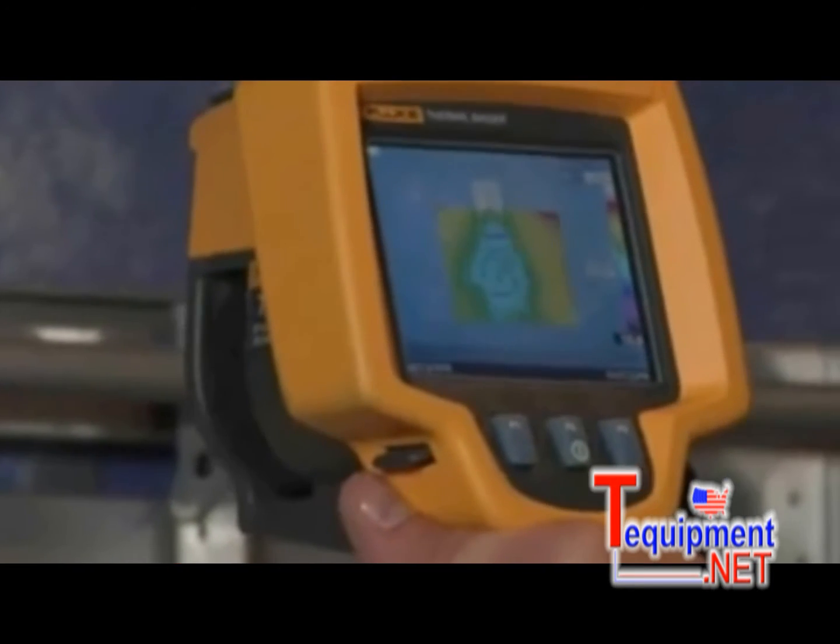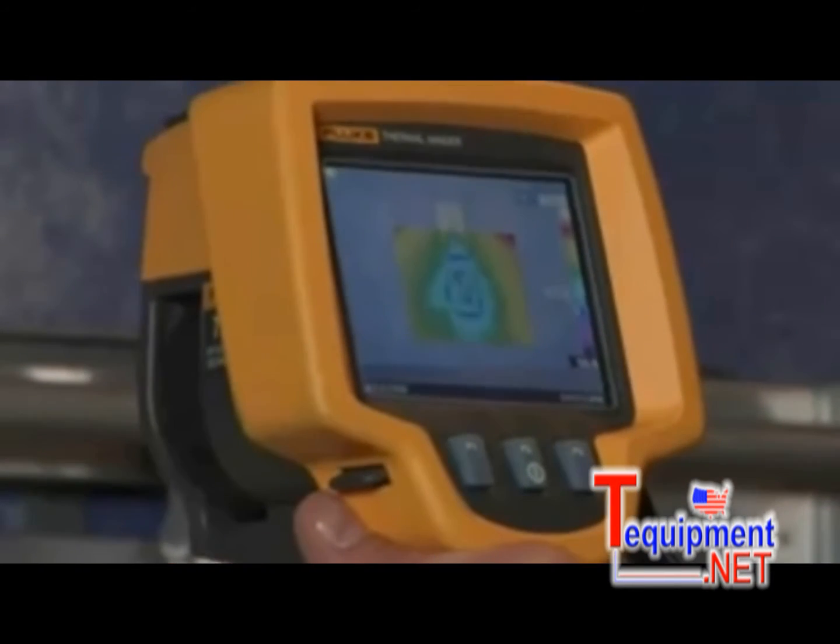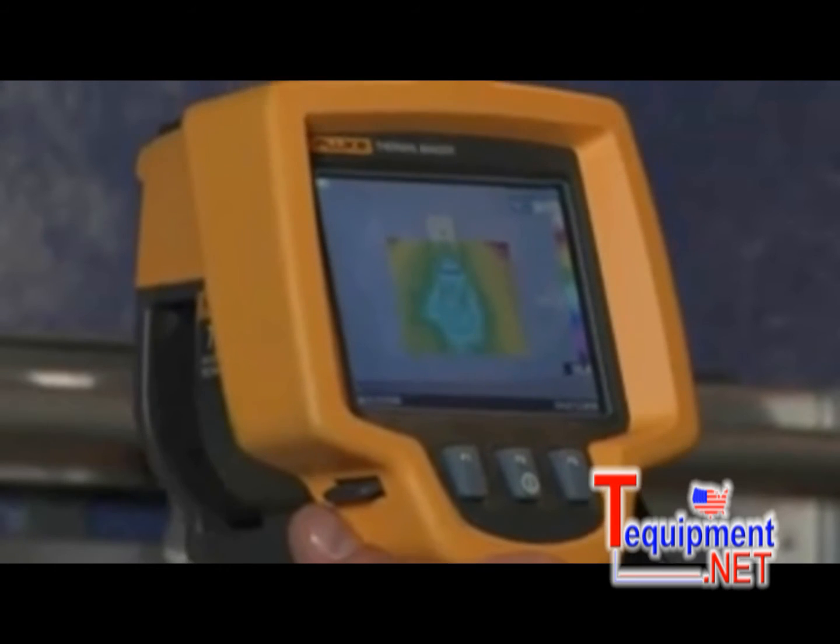Another classic problem, and a pretty easy fix for a homeowner, can be found around the electrical outlets. Look at this one through the Fluke TI-R1. You can see clear as day that cold air is seeping into the building. So as far as energy efficiency goes, this house could use some real upgrades, but let me show you some more significant problems I found — this is the stuff your clients are really going to want to know.